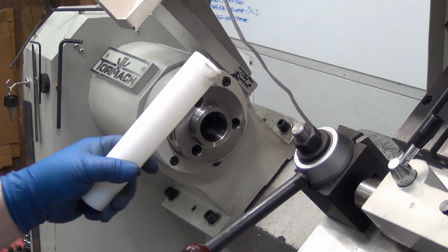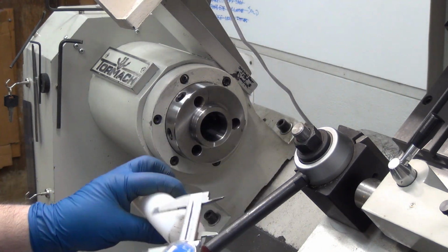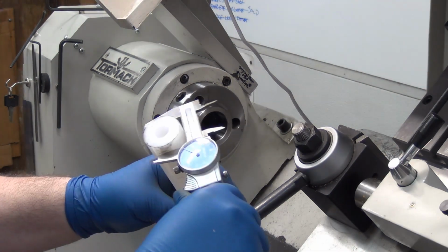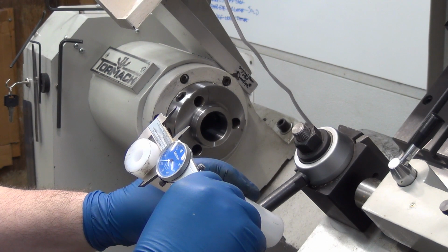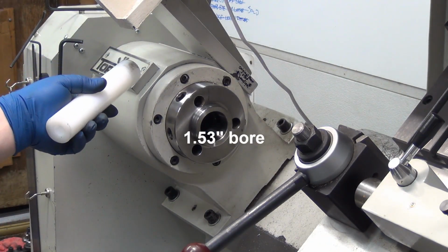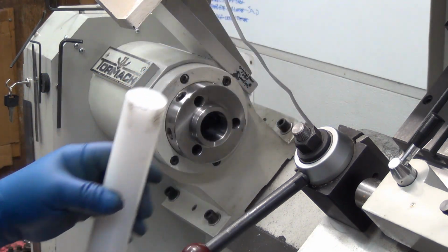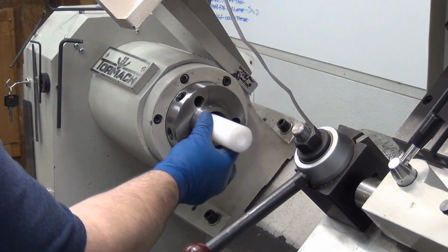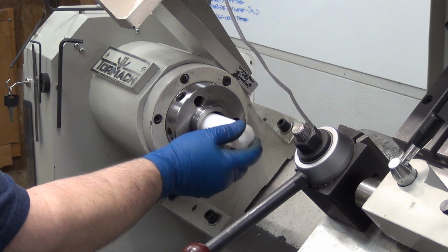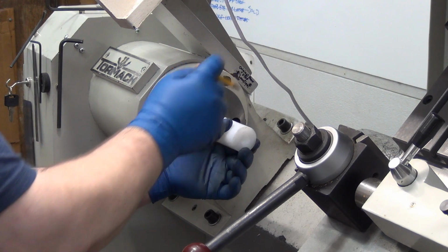And this is supposed to be 1 3/8, but they oversize it so you can cut it down. So if I go by where it hit on the marks there, this is actually 1.46, so that's supposed to be a 1.5 inch spindle bore. Well, I'm being shorted there by a good 40 thousandths. That makes the difference here. But at the very least, instead of it stopping here, I can get it in there. Even if I just stop at the lip there, it's about a 3/8 of an inch difference.